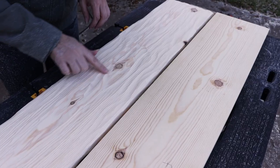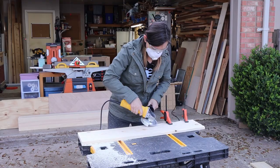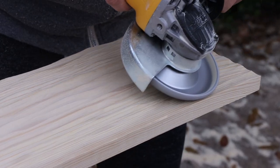Now, back in Viking times, pretty sure they didn't have joiners and planers and fancy things like that. We wanted the bed to look like it was hand-hewn, so to do this, we are using something called power carving. Now, power carving sounds a little intimidating, but it is super easy and really, really fun. Power carving! So to power carve, you take an angle grinder and you put on a shaping disc.